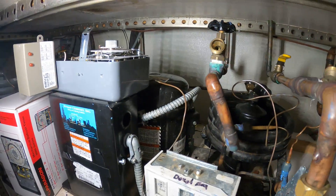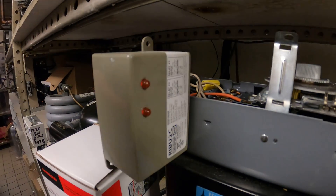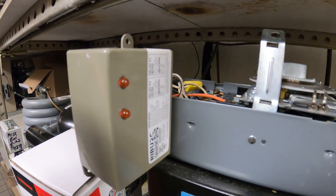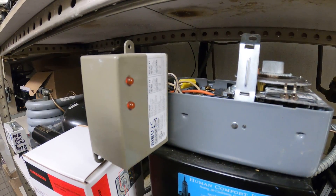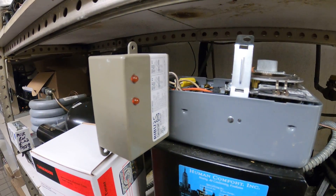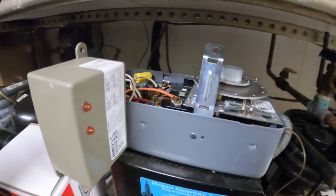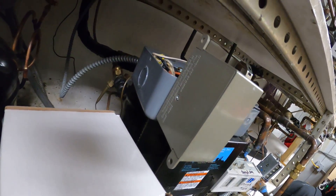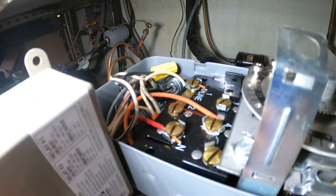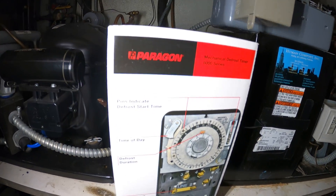Follow the power lines right there — I pulled the switch so power is off for the condensing unit. But we have a separate source of power for upstairs. This is a relay right here — a RIB relay — which is really cool. When the light turns on, that means the thermostat is calling. I also unplugged the refrigerator upstairs, so now all sources of power are off and we can safely change this clock.